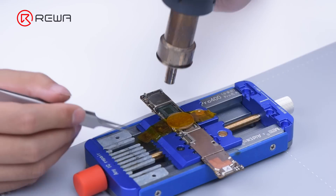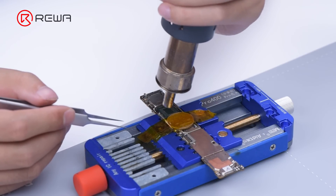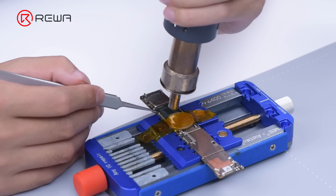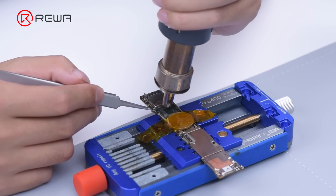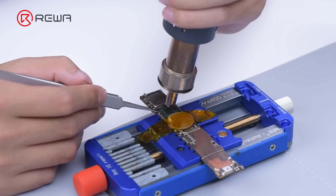The next step is to solder the CPU. Apply some paste flux. Align the CPU. Solder the CPU with hot air gun at 350 degrees Celsius and airflow 100. Touch the CPU gently with tweezers — if the CPU returns to position, the CPU is soldered well.